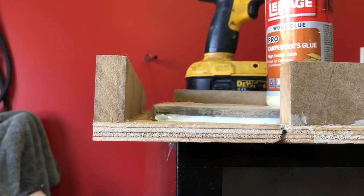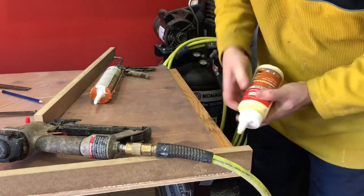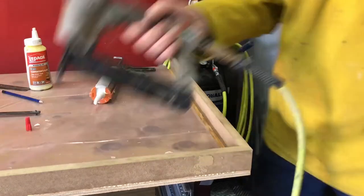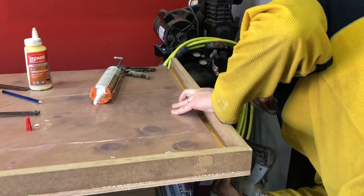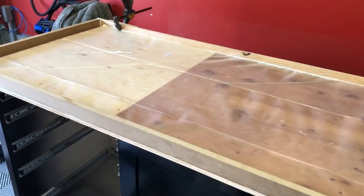Here's my finger drawing of what the concrete will look like when the mold is removed — that's exactly what it'll look like, the cross-hatched area. And here I'm just putting on some edging the same way I did before. You want to make sure you're overlapping your edges — you don't want your joints all in the same location — just to make sure it's nice and strong. I used carpenter's glue and inch-and-a-quarter brad nails, which should make it more than watertight enough.